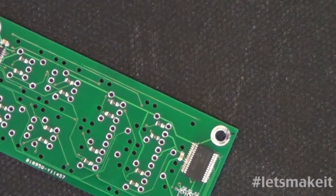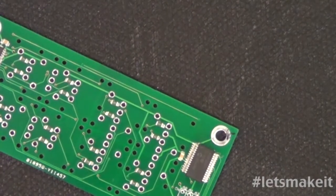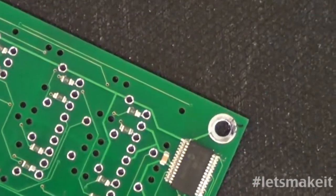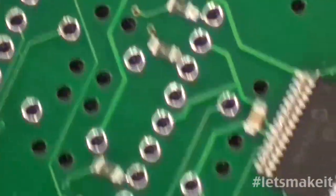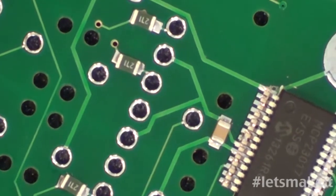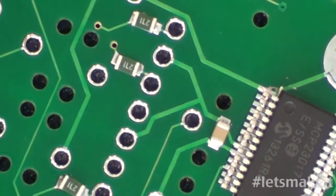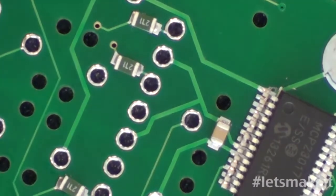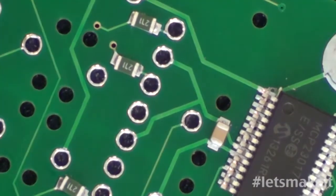Okay, I'm going to try to zoom this in a little bit so you can start seeing what's going to happen. You're going to start seeing the solder change color. See if I sit still, if it focuses. So when it changes color, it's starting to set up, and it eventually turns silver, which is when it starts to flow. We'll leave it like that for a little while.